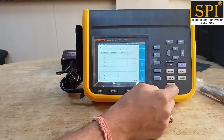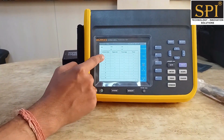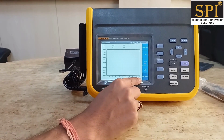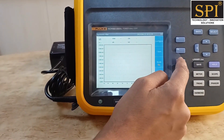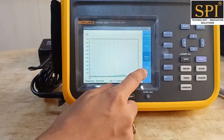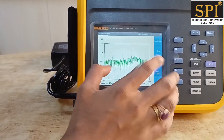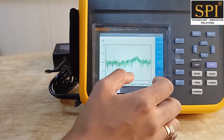In the harmonics mode, this instrument can measure harmonics up to the 100th harmonic. You can view results in table form or bar graph form — the first screen shows up to the 50th harmonic and the next page goes up to the 100th. You can also get an FFT diagram with either linear axis or logarithmic axis display. Additionally, you can log data with respect to time by setting up logging in the system for long-duration recording.